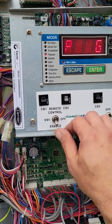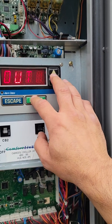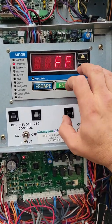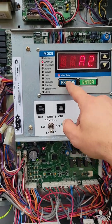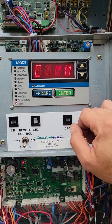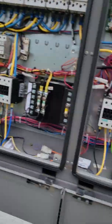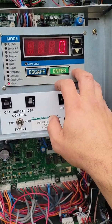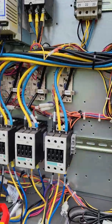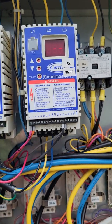With that being said, I'm going to go ahead and shut this off — circuit A. We're going to go back to service test. Compressor A2 is the one that is on — we're going to go ahead and shut that off. We have another alarm — current alarm 203, loss of communications. Just a redundant alarm that's never ending between this chiller and that chiller. We're just going to go ahead and reset this — it keeps going off because of what I'm doing. Done. We're going to switch that back off. What I want to get into with you guys, because I know there are not a lot of videos on the Carrier Motor Masters, we're going to go through a couple of steps here.